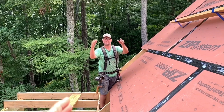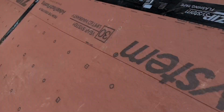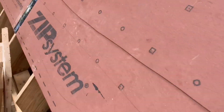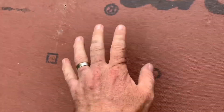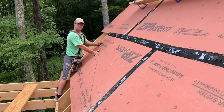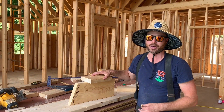We're going to snap a line where the top of these rafters are going to hit, then lay each rafter directly on top of the existing rafters under this sheeting. That means I don't really need to put a band board on this, which saves us a little time and material. While we're on the subject of framing roofs, I'm going to show you a cool jig I always make.